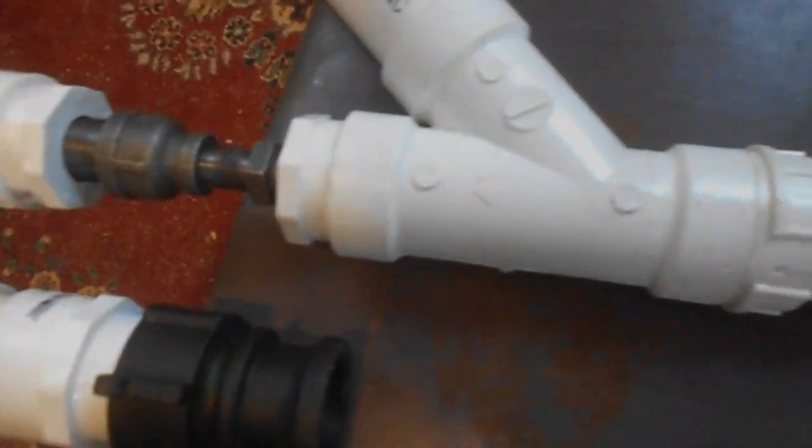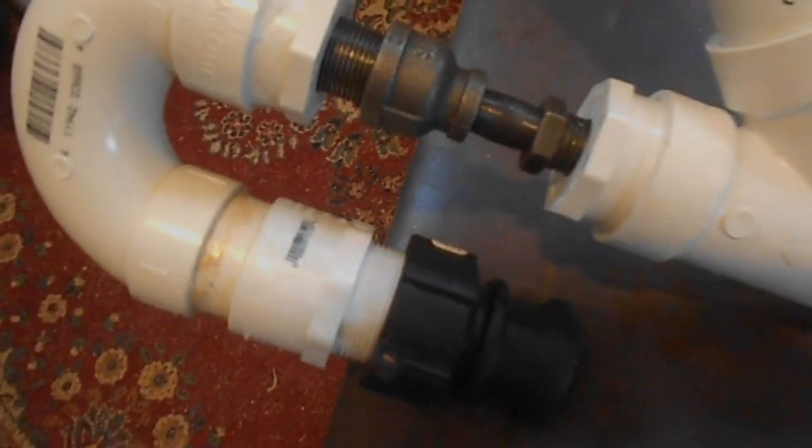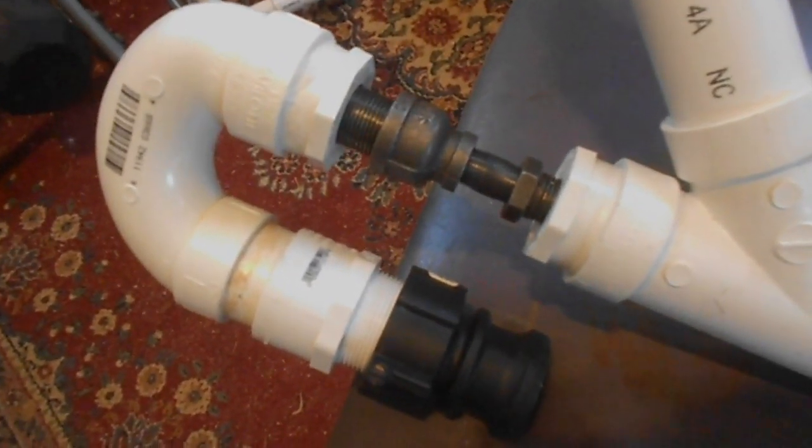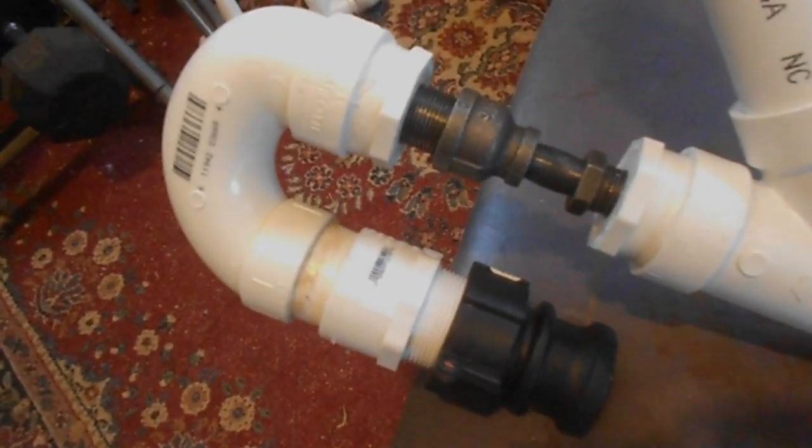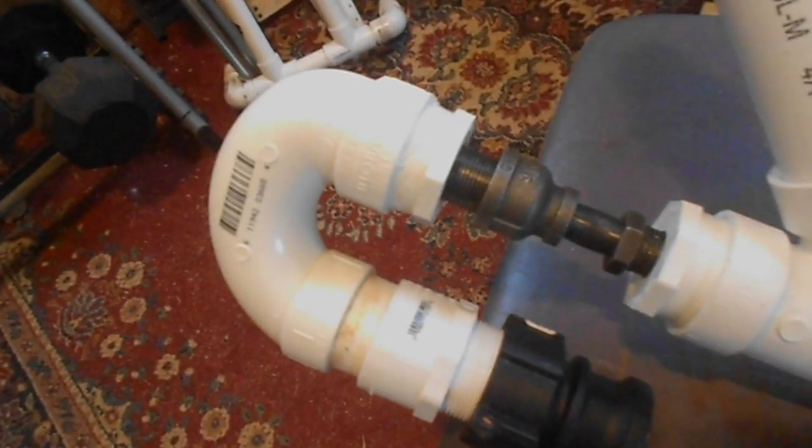While I was working on that, I figured I'd show you my little dredge nozzle I built. This is the one-and-a-half inch dredge nozzle I'm going to be running, and this is the jet right here. They say to use a ratio of 4 to 1 — so if you're running a 2-inch you go half an inch — and since this is a one-and-a-half inch, I'm using 3/8 inch as my jet size.